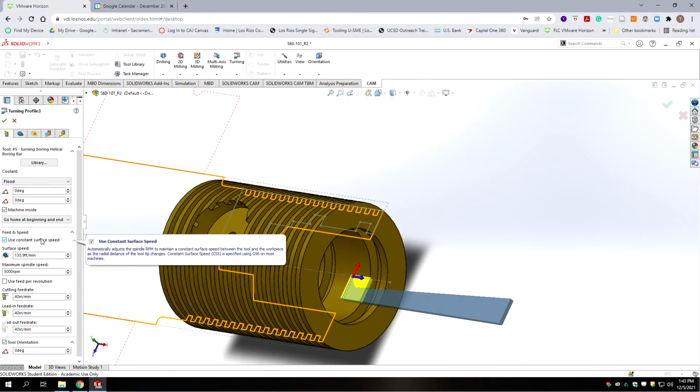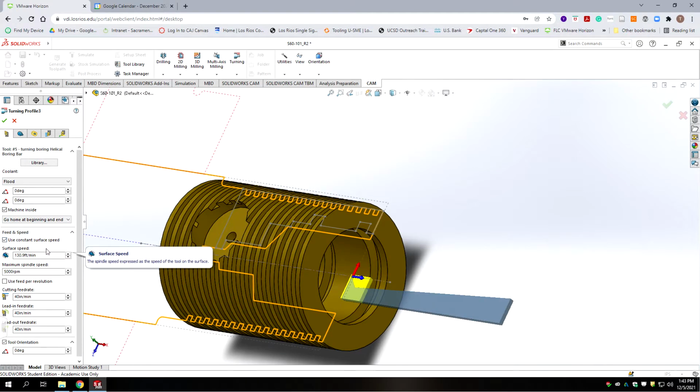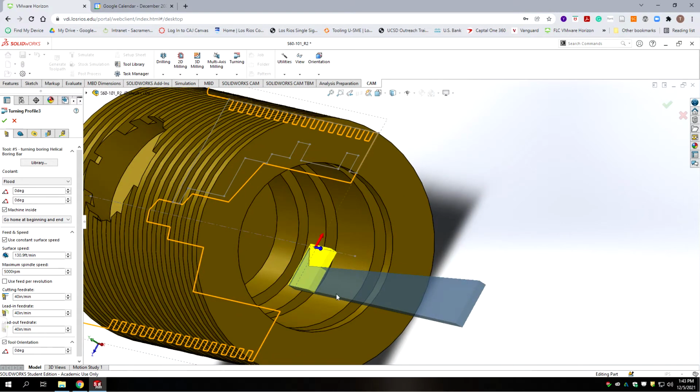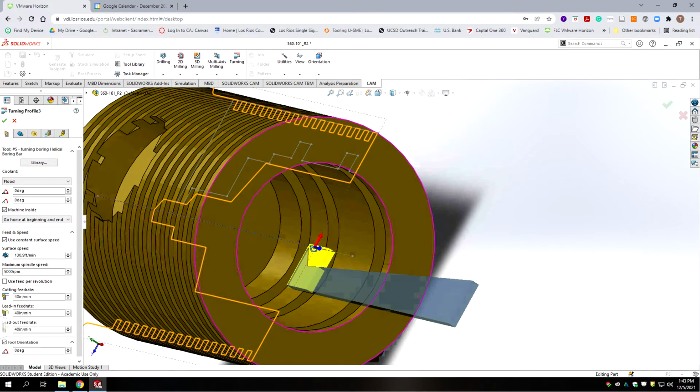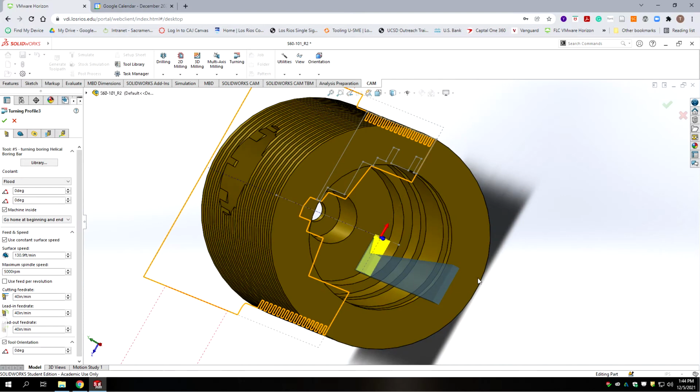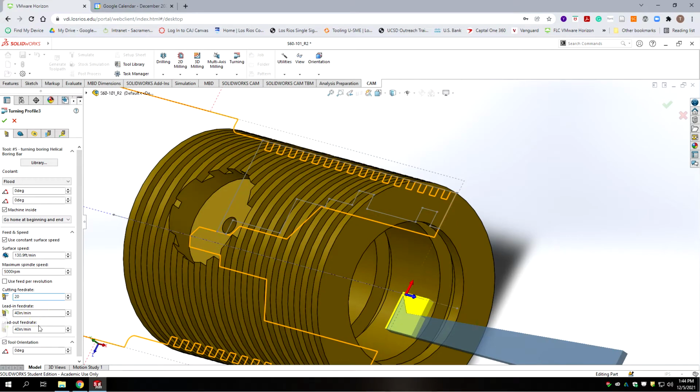Okay, and our first thing, and I want to note there was a mistake in the tutorial for building this tool, and you might have caught it in the last part I modeled. It will not affect the last part that was in the tutorial, but your boring bar should be thin like this, not a big rectangular block. Now the real cutter, again, does not reflect this at all. It's not an insert cutter, it's solid ground, it's actually round. In HSM, I selected the box that said round for this, and it still models it square. But it really doesn't matter as long as the toolpath that's generated puts the correct point from the center line in the program. I think 40 inches a minute was pretty optimistic for this tool.